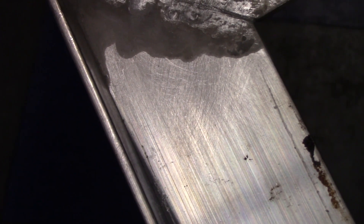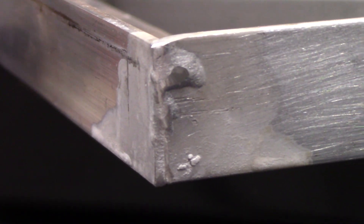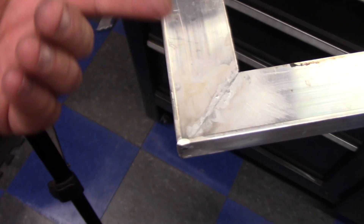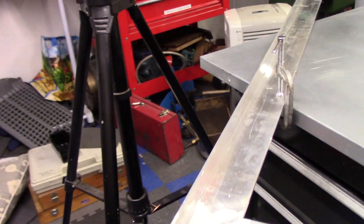The instructions say you don't have to clean up the flux, but I just scraped it really quick just to show you. You can see where the gap was, but it got all of it — even on the outside here. That's covered. You got a little bit of a blow-through here, which is just a drip, and you can kind of still see the outline, but it drew itself in. I'm sure if I get a flap disc and just clean this up, it'll work. It's not going to look the prettiest, but it's a table — you're not going to see it. Fine for me.